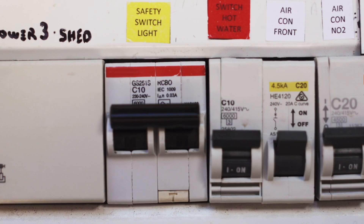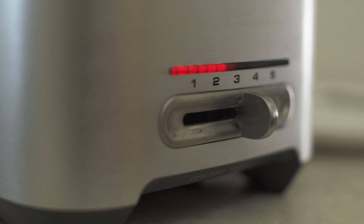If you have a fridge or air conditioner on that circuit, it's best to wait two or three minutes before turning them back on to prevent damage. If during the test your safety switch didn't make a sound and didn't switch off any lights or appliances, then it has failed. Contact your electrician to have it checked immediately as you will not be protected from electrical faults.